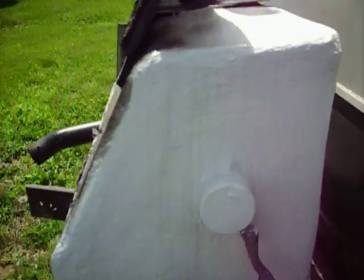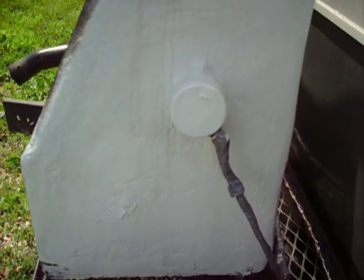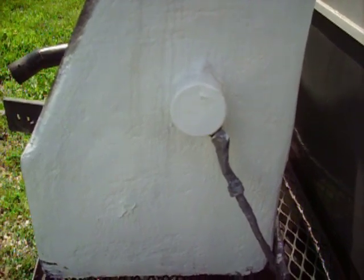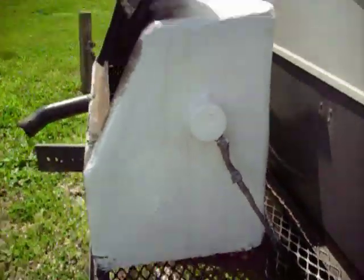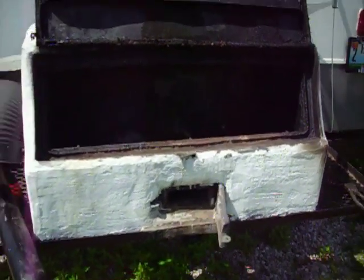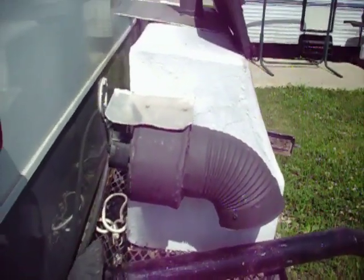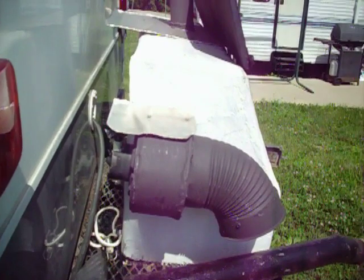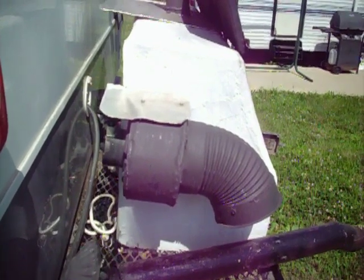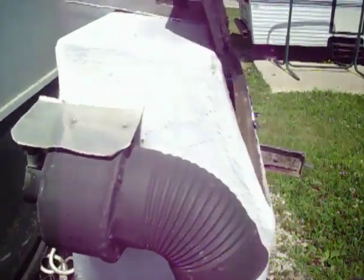The outside of the stove has a masonry coat on the outside of it, but it's insulated as well with dense deck insulation material, the same stuff they use for crickets on EPDM roofs. That is all around the outside of the stove in reflective foil tape. Then we have hardware cloth put over top of that dense deck material. We turn around and put the masonry on there so it gives it a good durable coat on the outside.